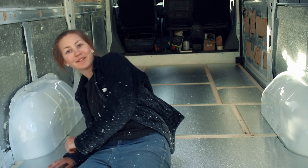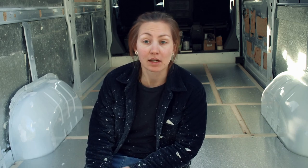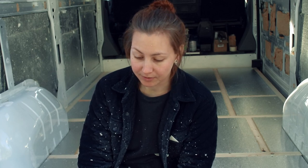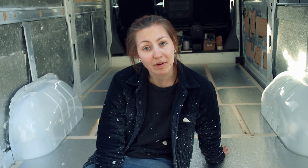This is what the final result looks like — I think it looks pretty nice. I found a much nicer way of cutting, or more like breaking, the pieces of insulation, so I'm not making as much of a mess. There was still some carving to do, but less curvature on this side made it easier. The next step will be to put aluminum tape on things to seal them up and create a continuous vapor barrier. But before that I first need to glue down these wooden beams. I'll do this tomorrow — remove everything, glue down the wooden beams, and put in the insulation in between. Thanks for watching, guys — see you tomorrow.